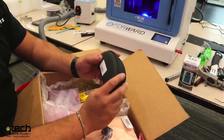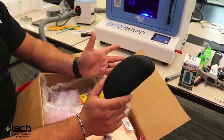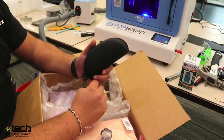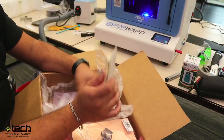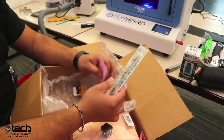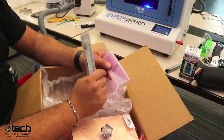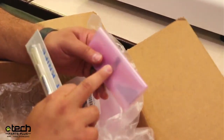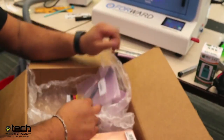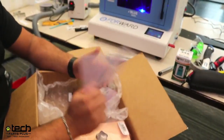We have a pair of safety glasses — you're dealing with a lot of broken glass. This is the recommended tool for prying off the back glass: basically an X-Acto blade holder, but we don't use the angle blade — you want to use this flat blade. It has a very fine point to get under the glass but is strong enough not to break while prying. We have a brush to clean off the back of the frame, used with the alcohol and microfiber.